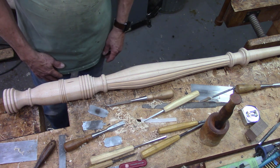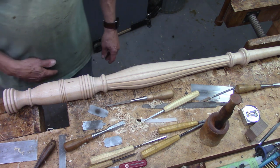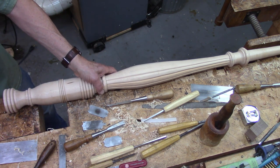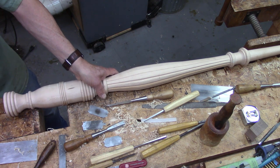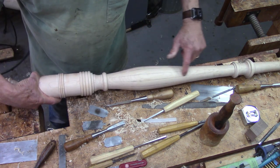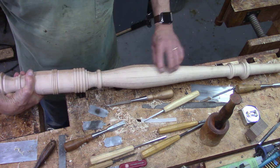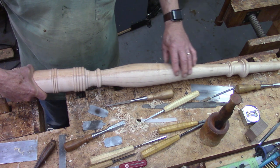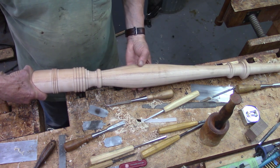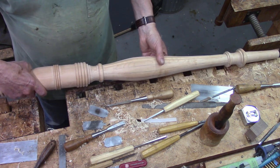I've been using some hand tools to make these reeds. First, here you can see the pencil lines that I made on the lathe, because I can index on the lathe. I have an indexer so I can get 12 lines positioned properly on that circumference with a pencil.